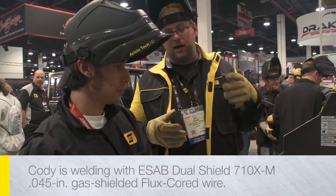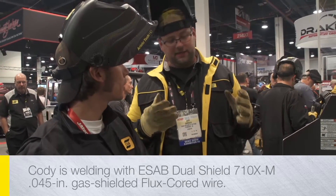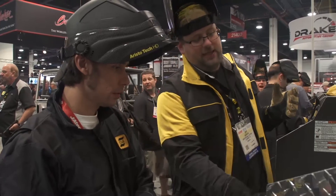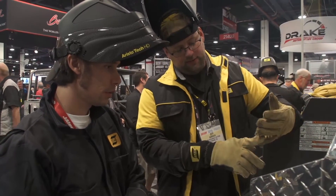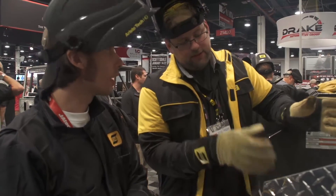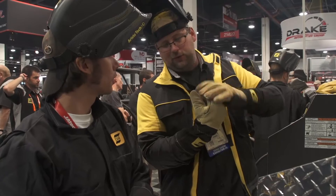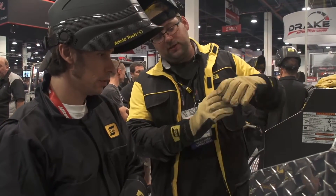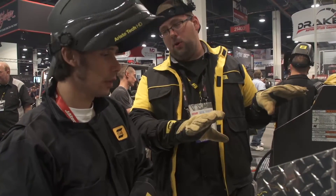The machine is very smooth and the wire has a very broad operating range. This is an all-position wire and it does shine in that position. On flux-core wires, the slag has two purposes — well, actually more than two. It helps clean, it helps protect, and last but not least, it's also the shelf — what we call the shelf — to hold the out-of-position weld pool. We also make flux-core wires that are flat and horizontal only, and the slag is a lot more fluid and it wets in even more.